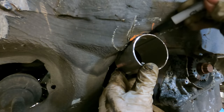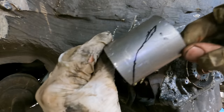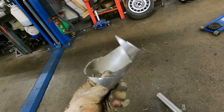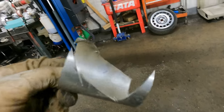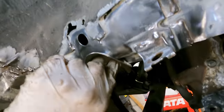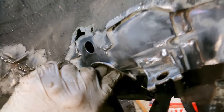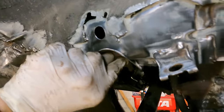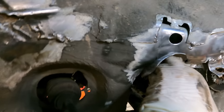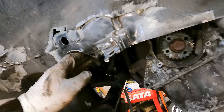We just draw around it — that's the shape we need. Here's that bit of pipe cut out, and the other half of our jigsaw piece is what is going to go in the hole. So that sits in there like that, all cut really nice and tight. I've left it a little bit long around the edges so when we trim it back I can weld it on and then trim it exactly the shape of the chassis leg — so it will look like a seamless join. So we're ready to tack in, I've just cleaned it all up around the edge, we are ready to weld.